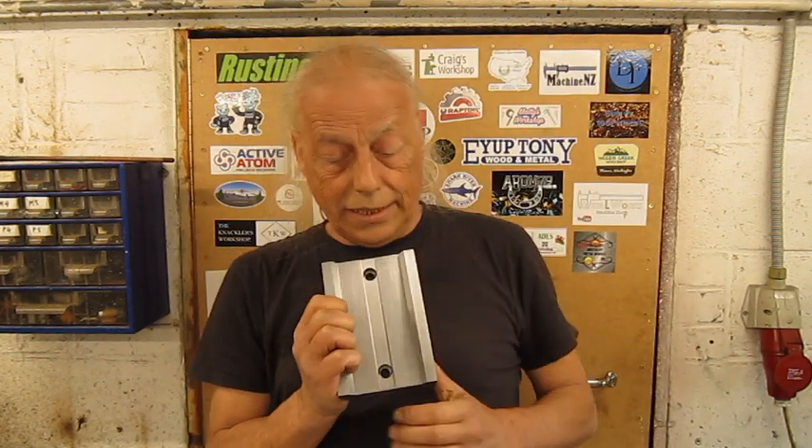Now let me tell you my little secret for finding the exact angle of this negative dovetail system. There was no measuring system. What I did was put the tool slide on the shaper at 30 degrees, cut it out, and came to give it a try — I thought it wasn't enough. So I put the tool slide at 30 degrees 30 minutes and that was the right angle. I just had to cut the right width. No measurements, no fiddling with special tools — just cut, give it a try, and after the third attempt it worked.